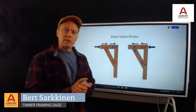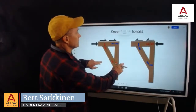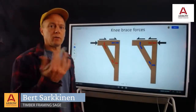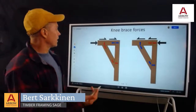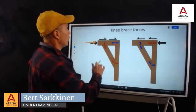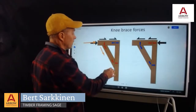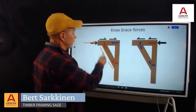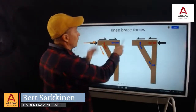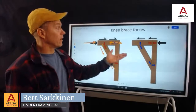So talking about lateral bracing and knee bracing, you can see here in this picture, the same knee brace with force applied different ways, the members change in compression and tension. When we're talking about force from this direction here and keeping a building up, well, this knee brace is now in compression. The forces go down, but that knee brace is resisting it. You've got compression on each of these joints. And then it's going to try to blow apart on this joint. Bam. And then it's in reverse on the other.